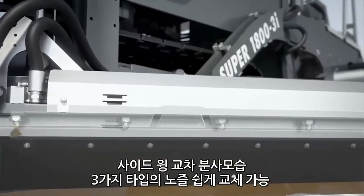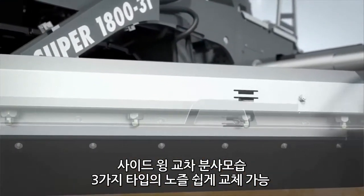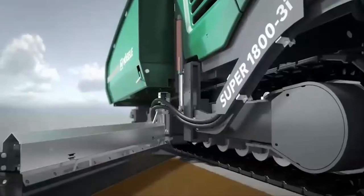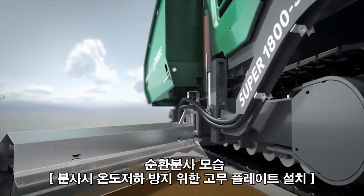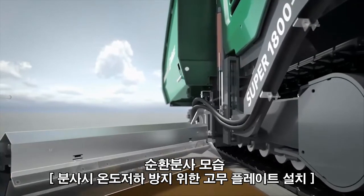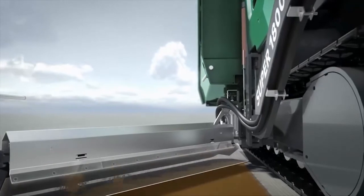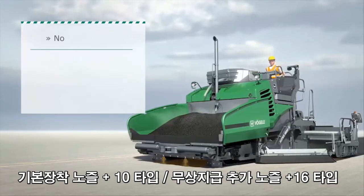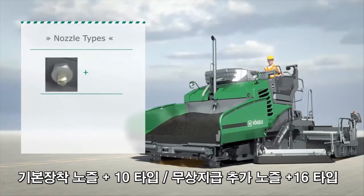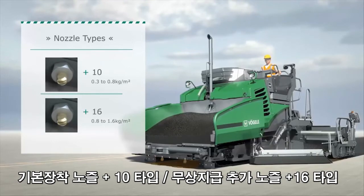The nozzles do not spray the emulsion continuously, but in pulsed operation. The spray pulses are controlled according to the selected rate of spread and the pave speed. This automatically controlled timing of the spray pulses prevents emulsion being applied in more than one layer. Precision-finished nozzle types of different size rates allow the rate of spread to be accurately metered for use in all spraying processes.